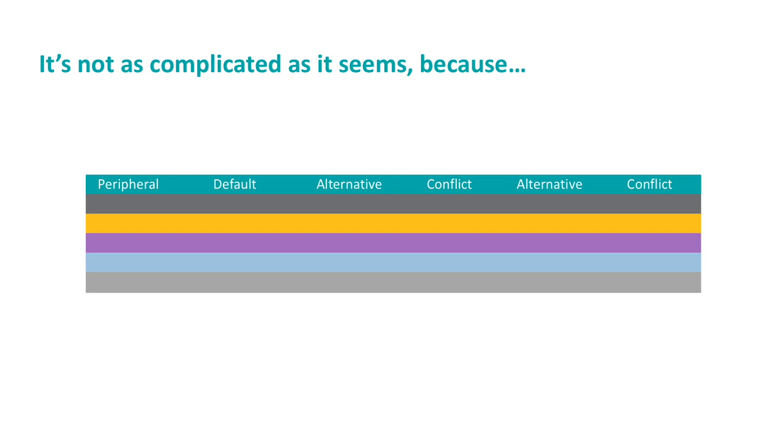But you may not even need to think about pin configuration at all. There are a couple of reasons. First, there really aren't that many peripherals that offer their connections on multiple pins. Consider, the serial wire debugger by default appears on bits 0 and 1, and offers duplicates on bits 8 and 9. Choose the alternative, and you lose I2C port 0. But why would you choose the alternative in the first place?